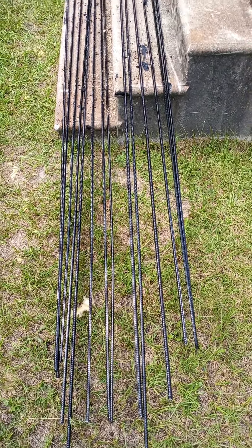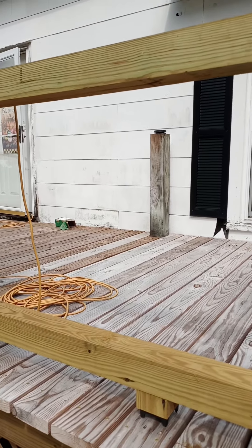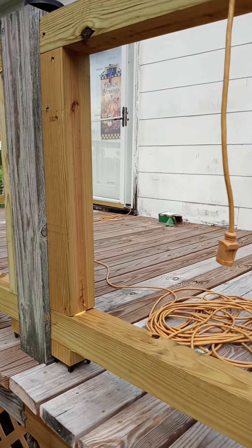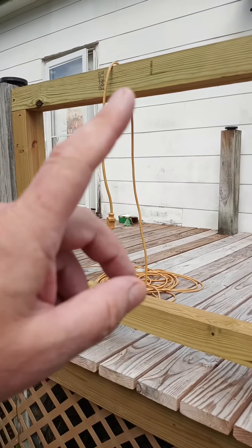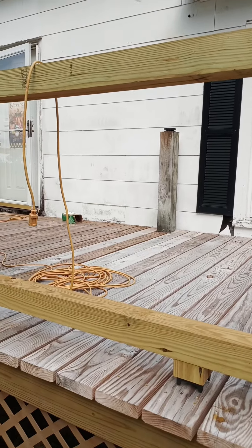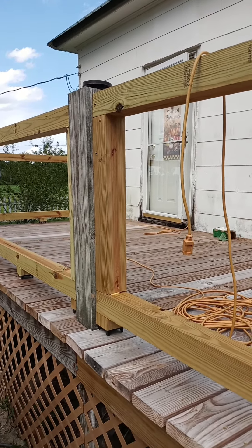I may have just a little bit left to do and I'll be done. I've divided these banisters — all these banisters are different measurements. What I'm going to do is come over from the side to another 4x4 post which I have to set up and drill. Then I'll have a middle area and on the other side will be a 4x4 post with that rebar going across. I've screwed and glued everything so that it'll hold up with people leaning up against it, and hopefully not sitting on it.